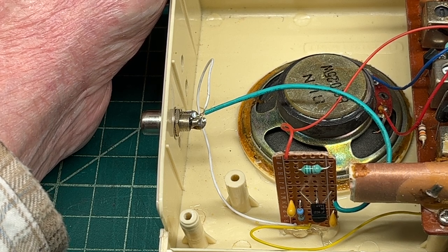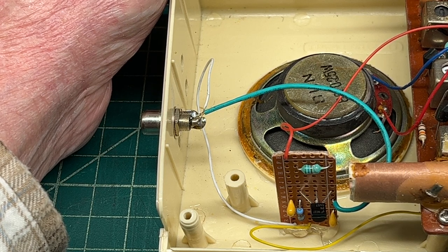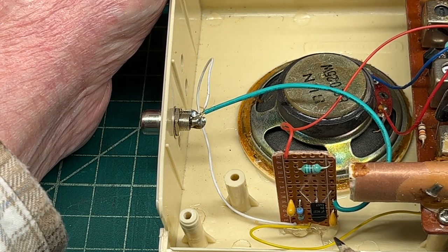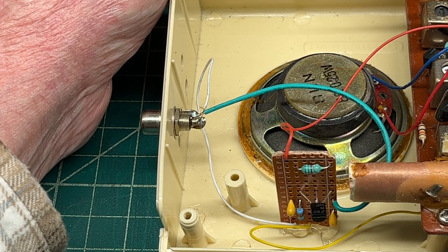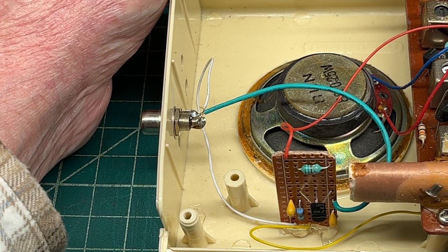I've just tapped in off the switch output side and to the ground of the receiver to power it. And I've got my antenna connection over here. The positioning was done just by empirical data, moving it back and forth. I marked that location and used the hot glue gun, affixed in a vertical position as you see.